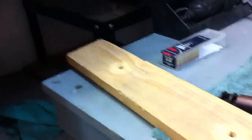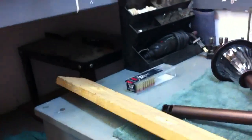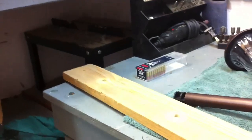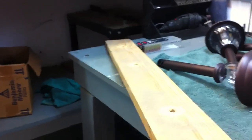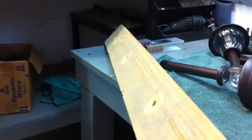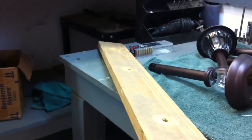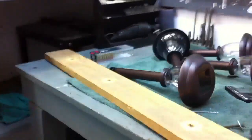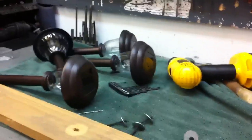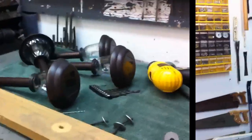I'm going to mount this board in a way so it can be swiveled to follow the path of the sun. In the morning, have this oriented north to south and tilt it a little bit to the east, then about noon set it straight up, and then in the afternoon turn it towards the west to get full charge out of these little solar panels. I'm going to set this up and show you what it looks like.